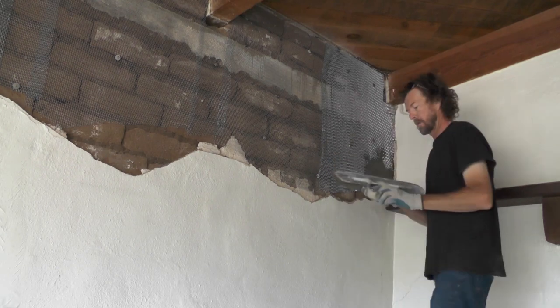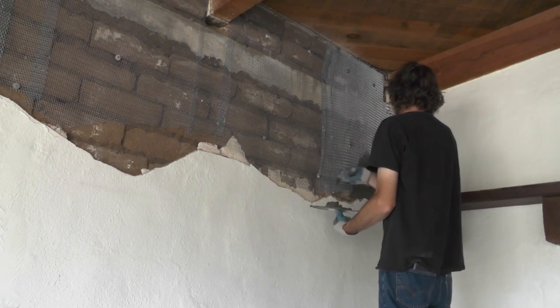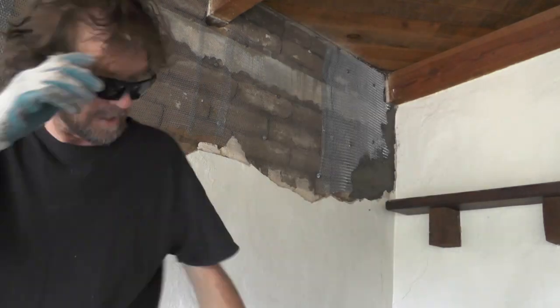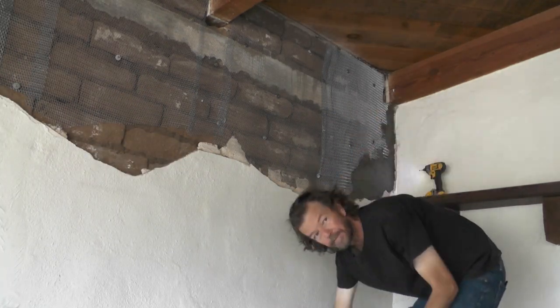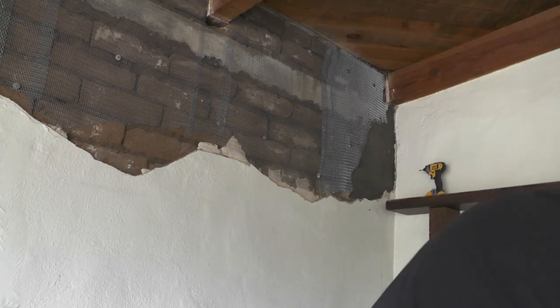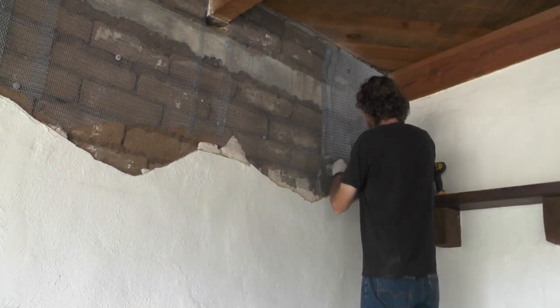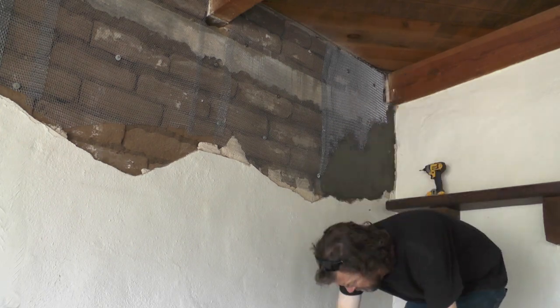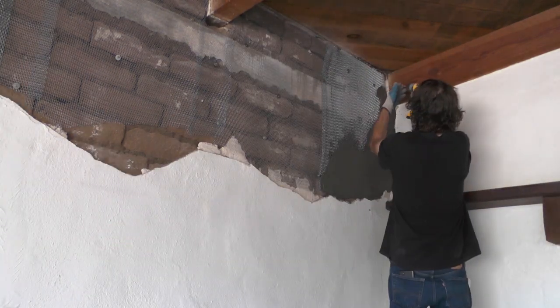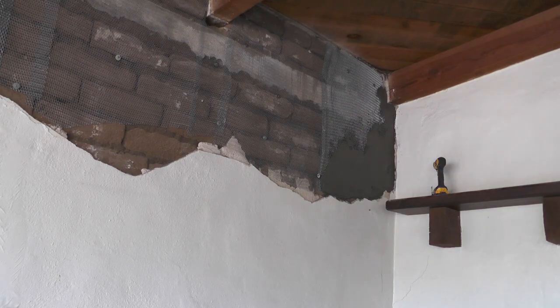You can see me starting on the wall and then realizing the metal was looser than I wanted it to be. You want it to be pretty tight, so I had to come back up with some screws and screwed it into the adobe brick. I used drywall screws, which were super effective — they drive themselves into rock all day long, it's just a powdered form, very similar to this adobe wall. We used longer nails throughout to hang the wire mesh, just to tighten it up here and there. No bounce equals a good base.